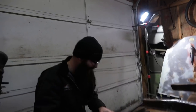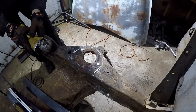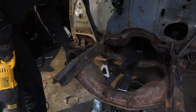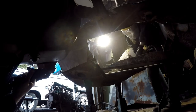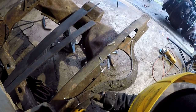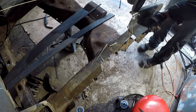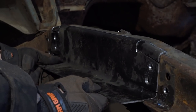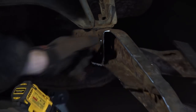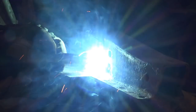Maybe we'll just cut the bottom part out — let's cut that out. To support the new piece we're going to weld in here, I've got a couple little plates and I've drilled holes into the frame on either side and into my piece on either side. It's just to hold everything together a little stronger, kind of fill in the holes and stiffen it up.